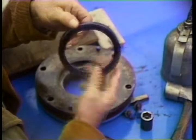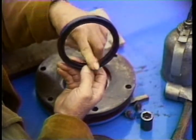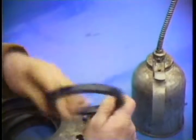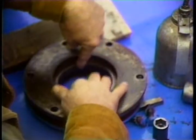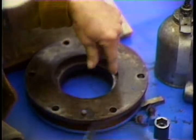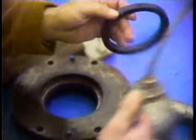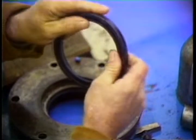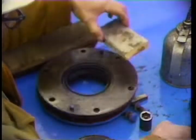When replacing the rings, it's very important that you point the sealing inner lip of each ring in the right direction. The side with the groove is the side with the lip. The first ring's lip should face the power end of the pump to keep the oil in the crankcase and out of the cradle. The next two rings should have their lips toward the fluid end to keep mud and water out of the gear end of the pump. Oil the lantern rings and wiper rings before installing. Place a wiper ring, lantern ring, and then another wiper ring in the diaphragm housing. The lips of the two wipers should face away from each other toward the outside of the housing. If you have to force a ring in, don't use a sharp or metal tool — use a block of wood so you don't damage the ring.